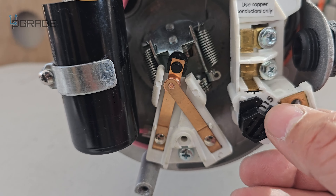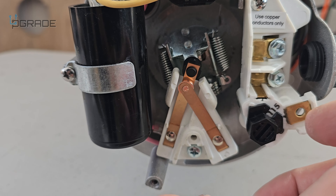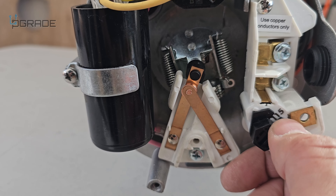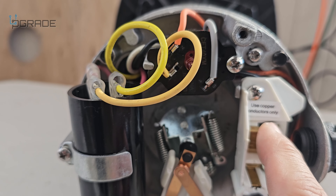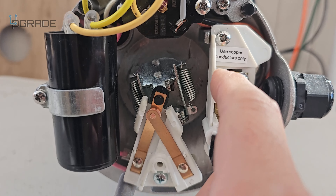Here's a very important thing you've got to be aware of: I set it to 115V on the voltage because I'm going to plug it into my home plug. It goes up to 230V — out of the box it's set to 230V. Be aware that you could burn out or knock your fuse box if you don't change it properly.